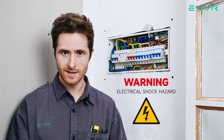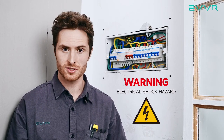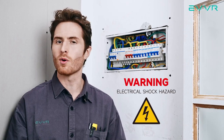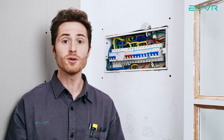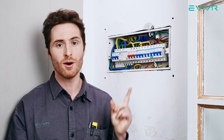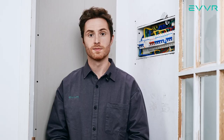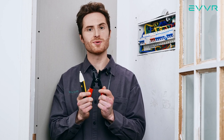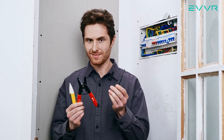First, a word of caution. These devices should only be installed by a qualified and licensed electrician. Please make sure to follow all of your local guidelines and legislation for electrical installation. Also, before installing the in-wall relay switch, we must make sure that the power is off at the main breaker or electrical service panel. Let's also prepare these three tools: voltage tester, cable cutter, and screwdriver.